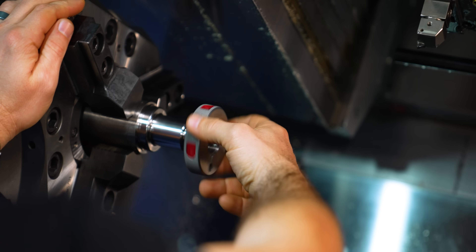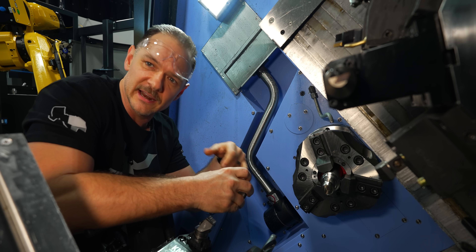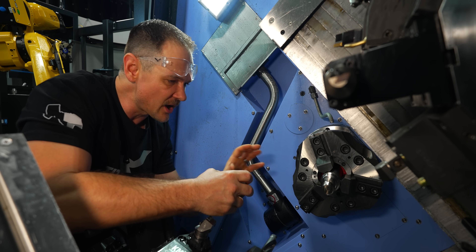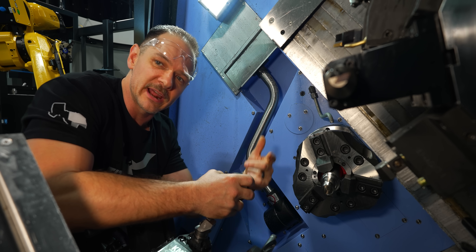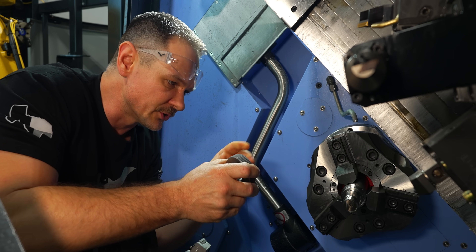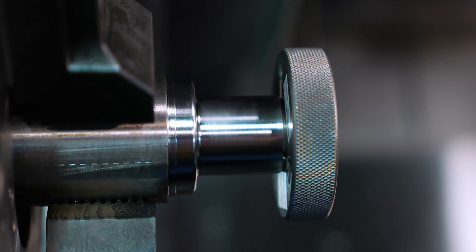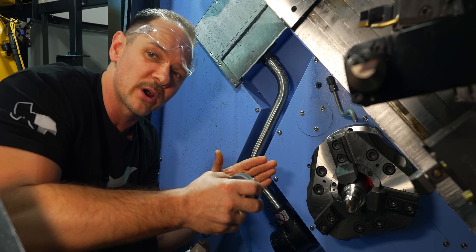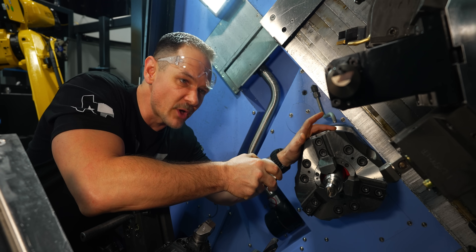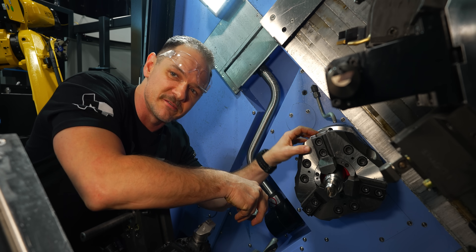With our thread gauge, we are good to go. We did the thread kind of like we did the OD — backed it off, checked it with the pitch mic, saw how far we needed to go in, then ran it one more time, and voilà, we got a good thread. A little tip: when using your ring gauge, make sure you go all the way back to that shoulder. If you haven't, you probably need to move your program in or bump your tool in a little bit in Z. We're almost done with Op 1 — we have to put a small hole in the thread relief and then finish the ID.